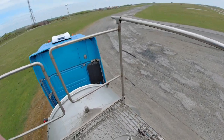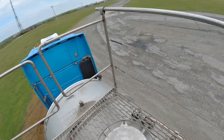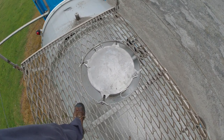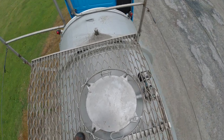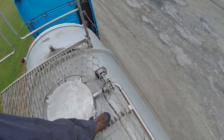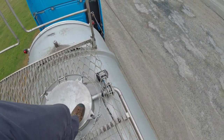Some breather valves can get sticky over time — you sometimes have to keep working with it to get it to open. If it doesn't open, the safest solution is to open a pot lid to relieve pressure, though that's very dependent on what product you're dealing with. For health and safety: always put the railings up before going up here, maintain three points of contact when climbing, and make sure the railings stay up. Check them as soon as you come up.